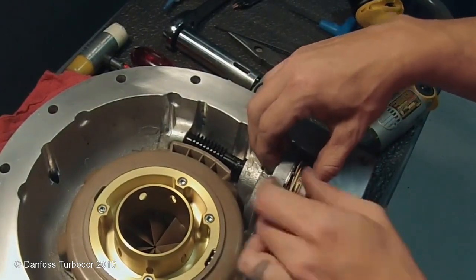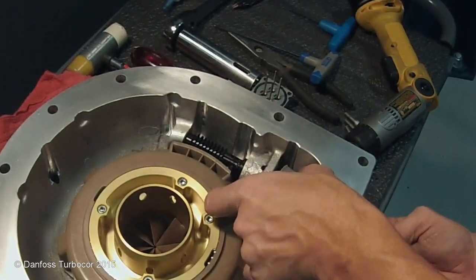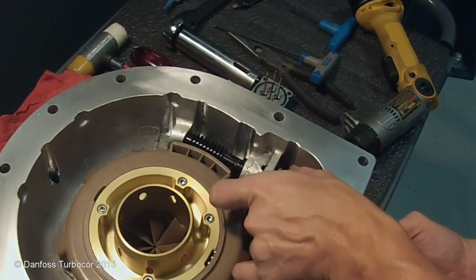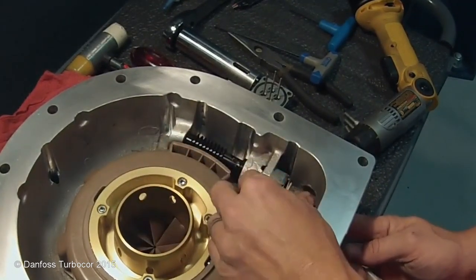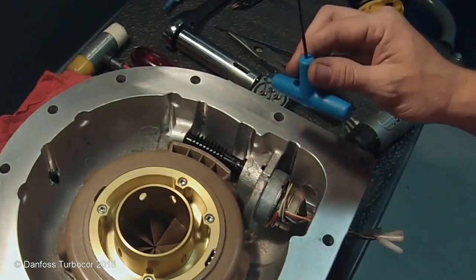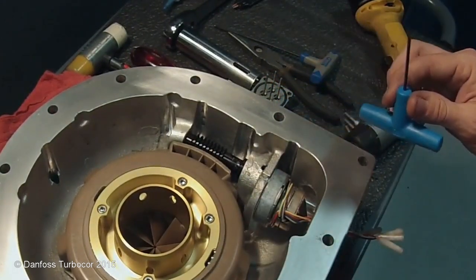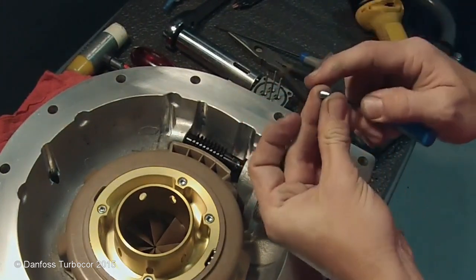Slide the motor shaft into the top of the worm gear with the motor locating screw in the notch of the IGV housing. Verify the motor shaft is visible through the set screw access hole and the flat of the motor shaft is facing up. Using the 2.5 mm hex tool, put a small amount of Loctite on the threads of the set screw.